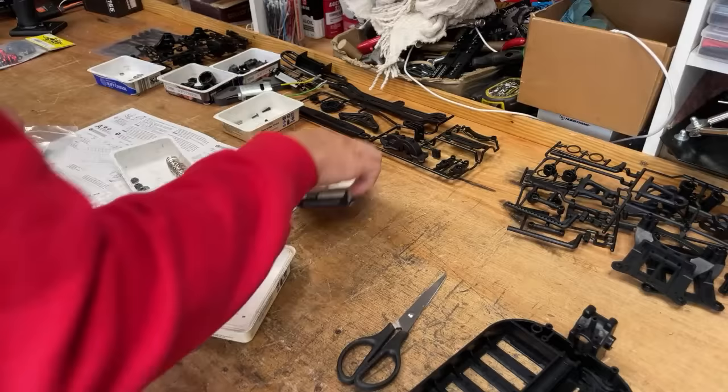Right. And then we've got these things here. And that doesn't even... Look. Got these bits there, but they don't even show on this part. So, all right, we've got those screws there, and we need one there and one there. 3x10. So I've got my vernier caliper here. We need a 3x10 countersink. Hopefully that's these. So when you measure countersinks, you measure the whole thing. So that's near enough. I'll go with 10 on that one.